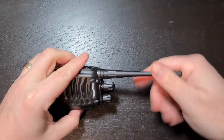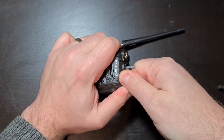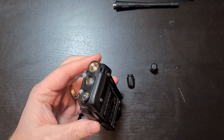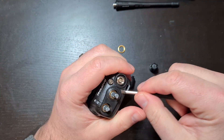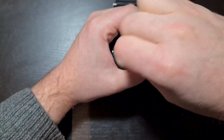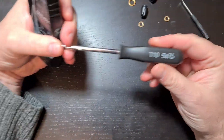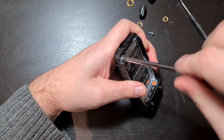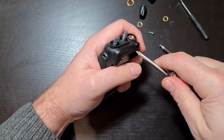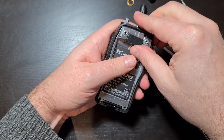With the 888 tested, unscrew the antenna — we'll need it later — pull off the two knobs with a bit of force, and remove the battery. Then there are three washers on top of the radio; they're fiddly but using a sharp spike you can spin them to release them and they twist off. We need two different screwdrivers: a Torx T10 for the two star-shaped screws — keep those — and a normal screwdriver for two other screws which we won't need again.